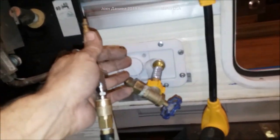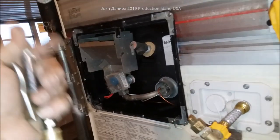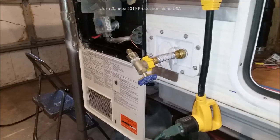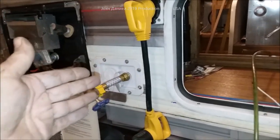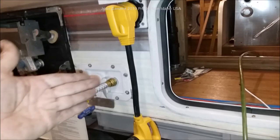I've set my compressor at 65 PSI because I really wanted to test this. That water heater is an older water heater — even though it hasn't hardly been used, it's still older. What we've got here is the ability to test your system and at the same time verify whether or not you've got leaks, a split in the pipe, or anything else. If you just want to set your compressor for 25 PSI, you can do that instead of making a big mess adding water to your system.